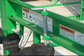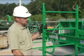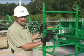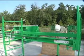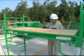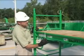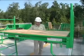This is the platform lock. It locks the platform in place so it can't be popped out inadvertently by wind or anything like that. First, get it out of the way when you install the plank, and second, when you put it on top of the plank it assures the plank is seated properly in the slot on the side frame. Now for the last part of assembly — installing the working deck. It has handholds; utilize those. From the side, pick up the deck, place it on top of the scaffolding, set it down on the truss assembly, move it into place, make sure it seats properly, then install the platform locks on both sides. This is the completed utility tower baker-style scaffolding ready for use.